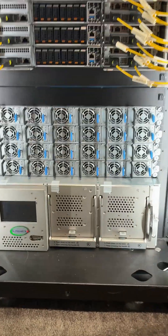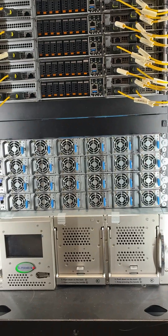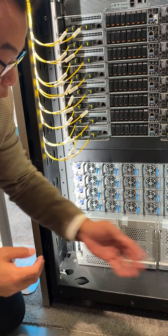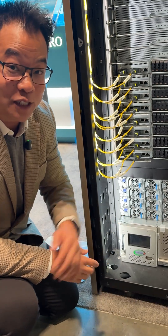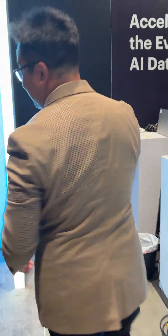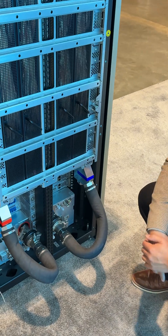Second thing, let's take you to the bottom. This is our homemade Supermicro 250 kilowatt CDU. It's got built-in redundancies for pumping — two pumps for redundancy and three power supplies. This will give you all of the cooling that you need for GB200. Let me take you to the back to show you where you can see the hot and cold coming in, because it's actually color labeled — red for hot and blue for cold.